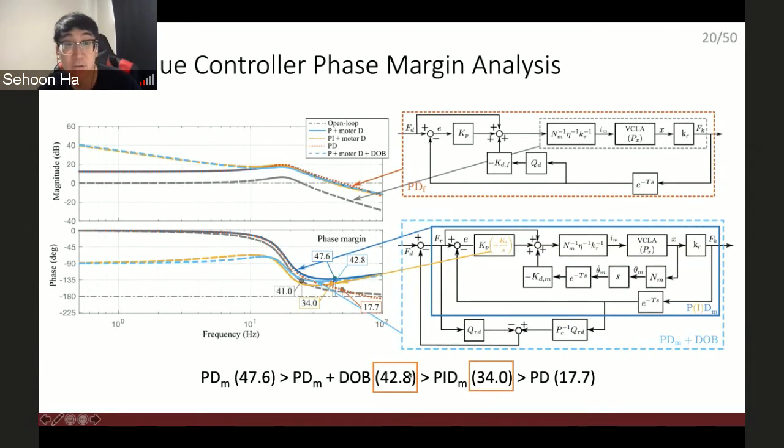I have a quick question. I believe this analysis depends on the selection of the task. And even within the same task, it might depend on other variables, such as the phase of the motion. So what's the task and what is your assumption here? So this is only about the single actuator, and only about the torque tracking. There is no high level multi-degree of freedom robot here. How did you define the target torque? Different torque trajectories might give you different numbers. So this is the chirp signal, sweeping all the frequencies. It's a sinusoidal motion, starting from the slow signal and then testing the high frequency command. And it plots the magnitude and the phase of the output of the actuator.